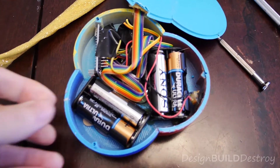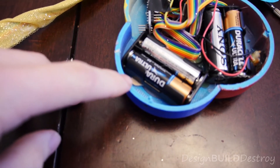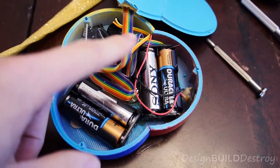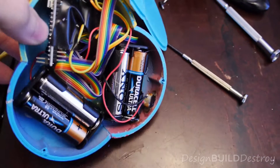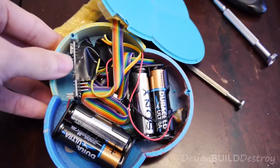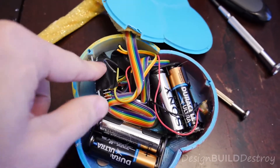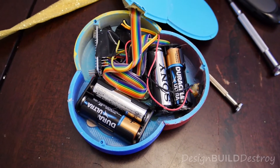NeoPixels in the backpack are glued down to cut popsicle sticks, and then that's glued across the opening for the orbs so the light can shine through. The speaker and battery packs are also hot glued down into the case, but I kept the Nano and the DF player loose so I can pull them up to reprogram if needed, with electrical tape around them to keep pins from shorting out if they shift around.